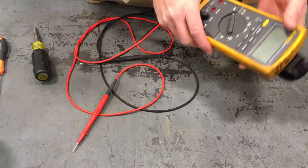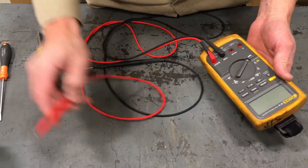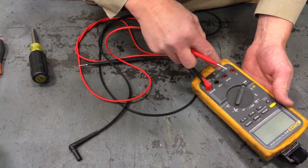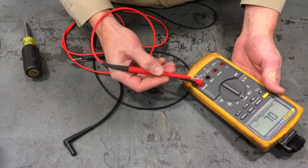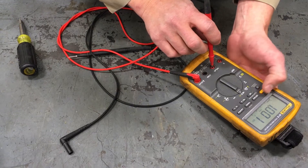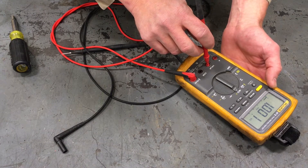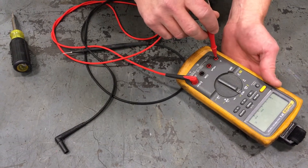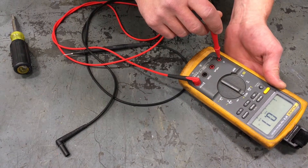If you've blown a fuse in your meter or the battery is dead, you have to take it apart. I'll show you a quick way to test if you've actually blown a fuse. Switch the meter to measure resistance and with the red lead plugged in, you can measure continuity through each port. The 400 milliamp fused current measuring port will show 1k ohm because there's a 1k fusible resistor in there — that's what a good fuse looks like. The 10 amp port will show no resistance through it, so we have good continuity.